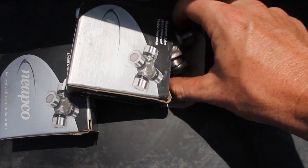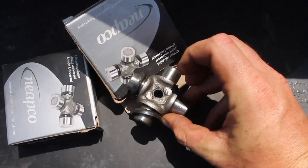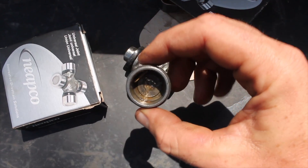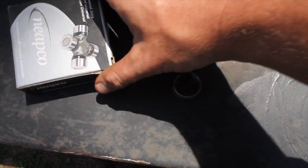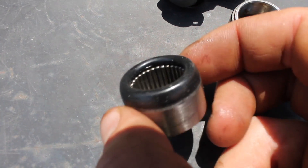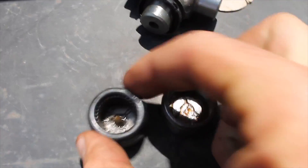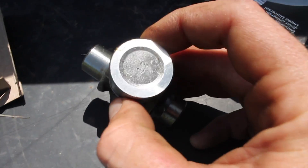I'm going to show you here what these universal joints look like when they come in a box. These are the universal joints that we used. This is one that we had broken — that's the universal joint; the grease fitting fits right there. This is a bearing. If you look inside there, you'll see one pin and the other pins are missing. This is how your bearings should look — you've got a row of pins on the inside. This is the one we busted; all the pins fell out. These will slide over these, and it's real easy to do when it's not inside the yoke.